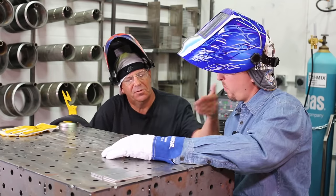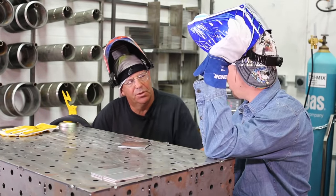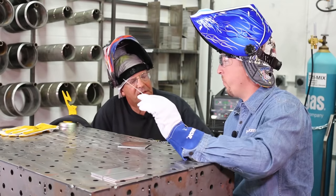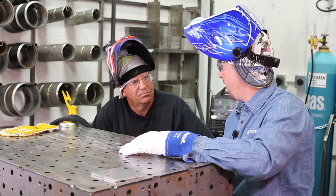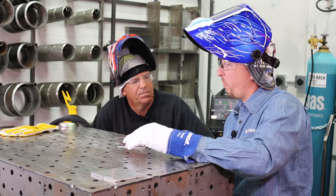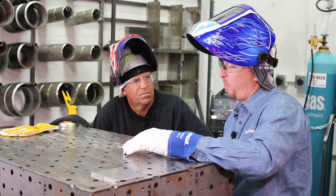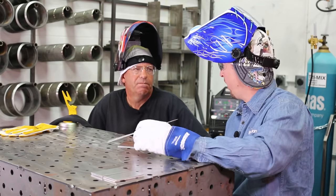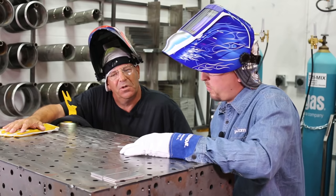I was watching over your right shoulder and it looked like it was kind of balling off a little bit. Do you push sometimes — do you add filler wire and push to get that heat sink in your bead? In the artwork, a lot of times I will add a lot of extra filler into the actual puddle to get the buildup. But on a flat joint like this I wouldn't put a lot of extra material in. You want to do a lap weld? Sure — do a lap and then a T.